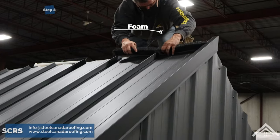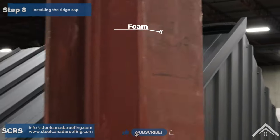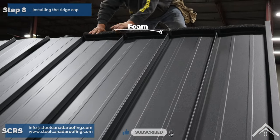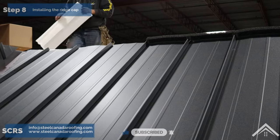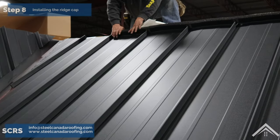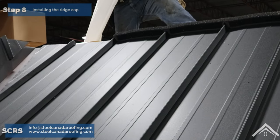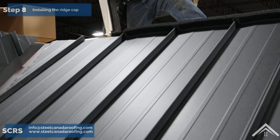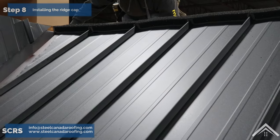Step eight, install the ridge cap. Install perforated foam, which is custom made to the ridge to allow ventilation while preventing weather and pests from getting in.